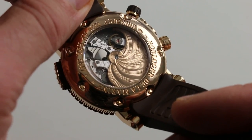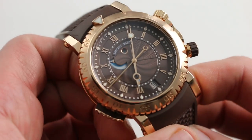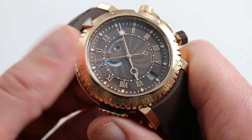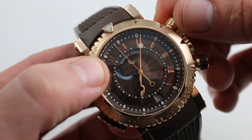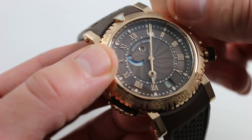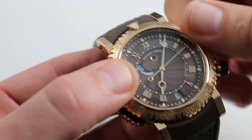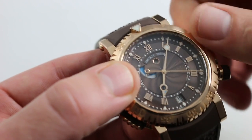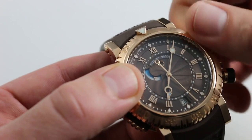It's important to note that the watch will not be allowed to run down completely when the alarm runs out, so you can run the alarm to exhaustion without stopping the watch. With the alarm off, you can notice the toggle jumps — it's a little blue musical note — and the alarm power reserve at 10 o'clock has run all the way to empty. Now this crown, flush to the case, thread it out because it is a screw-down crown and begin turning it. You'll note the alarm power reserve begins to sweep across its expanse; within that aperture it's the little gold triangle that indicates the state of wind. Importantly, you wind both the alarm and the mainspring barrel with this same crown in this same position.